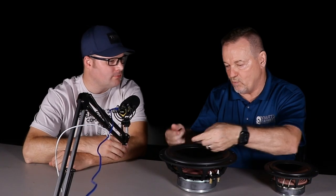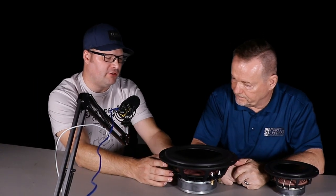At higher frequencies, sound emanates concentrically from the outer portions of the cone. Without a smooth transition, you can get phase cancellation — some sound waves going one way while others are 90 degrees or more out of phase — causing nulls in the frequency response.